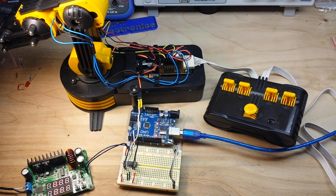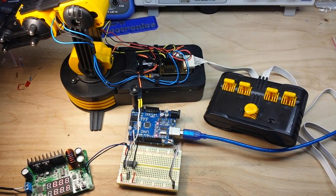Hey, what's happening guys — we are back with the robotic arm, this is hacking the robotic arm part three. Now if you remember in the first part I showed you how to use the L293 chip to control the robot arm, simply by switching input one high and input two low to turn one way, and input two high input one low to switch in another direction.